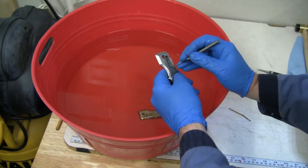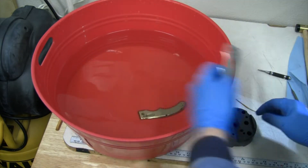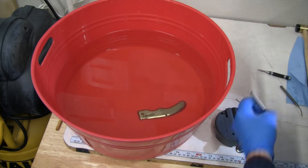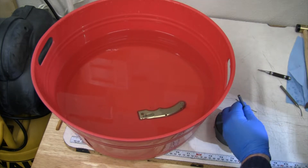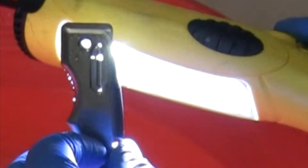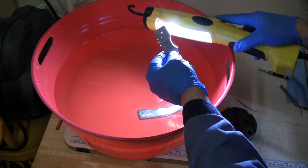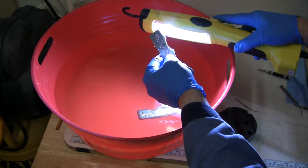All this banging and pushing and trying different things is part of my learning process. My recommendation after trying it: just put it back in the ferric chloride and let it dissolve some more. I keep trying — give it just a tap, see what happens. It still has a little strength to it. Here's about where I realize it's not coming out this time. There's just a little sliver of tap left in that bottom hole. It's almost completely eaten away but there's enough left that I still can't quite bang it out.